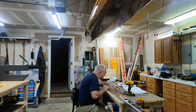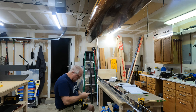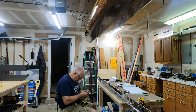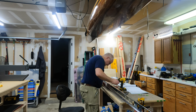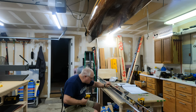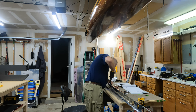A little bit later, there are nine holes that you drill or countersink into the spar flange. I went through and marked each of the nine, then used a machine countersink tool and slowly sneak up on the depth, because it's easier to remove material than to put it back. You can see here I'm getting the depth just right and checking it with the rivet until it's flush.